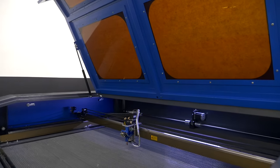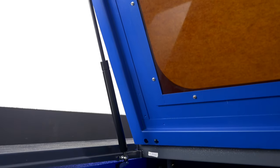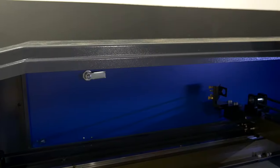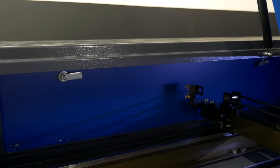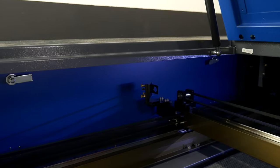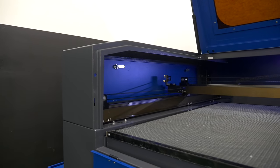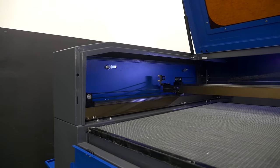The rigid frame construction increases durability and reliability of the machine. The bed metal walls are 2.9 millimeters thick, which virtually eliminates vibrations — relevant for engraving when active inertia is created. At Watson, all machine frames are heat-treated to ensure that the accuracy of the machine will be maintained for several years.